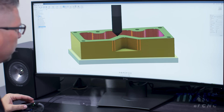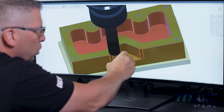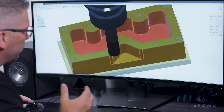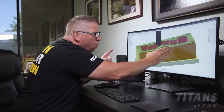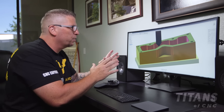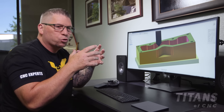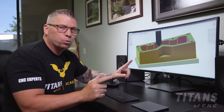On the bottom surface, the closer I get to the tip, the farther the tool has to be away from the surface — meaning the chamfer would only be over here because the tool was pulled away. So what I'm going to do is call it a larger diameter so the software places the tool right up against the wall but deeper, getting the chamfer all the way over. If you're running Inconel with a six-flute tool near a wall, call it a much bigger tool so you can use the top and get it close to the wall, leaving the biggest chamfer possible.